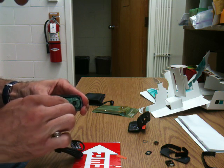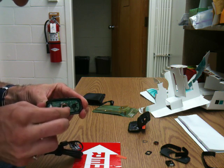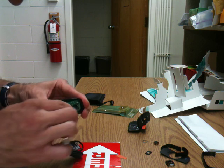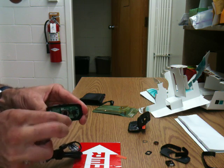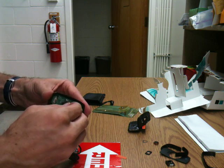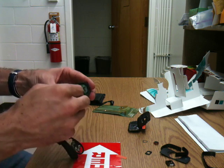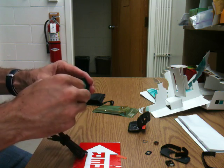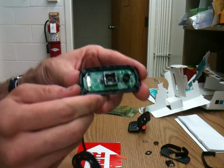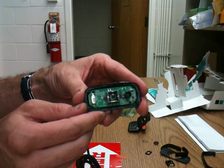My job here is to pry off the lens — I'll take the entire assembly with it. There are some wires that wrap around it, presumably for the solenoid that is actuated to move it back and forth. It really just rips off; it's only these thin gauge wires holding it on. I'll pull it off and remove any stray wires. And now I've exposed the bare CCD. At this point, it's suitable as a laser camera.